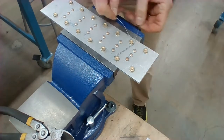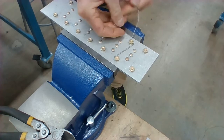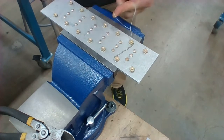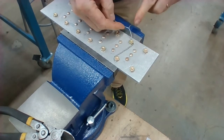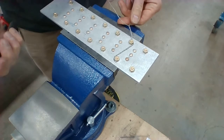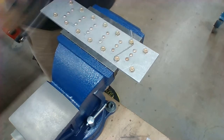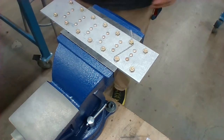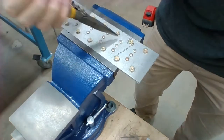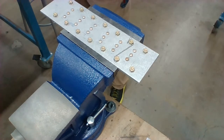Now when I come out, I'm going to go the opposite way — my left is going to go under and my right is going to go on top. I'm just going to continue doing this for about an inch or so. That's about as much as we want. I'm going to cut off my end with about an inch left, and then use the needle nose pliers to tuck that under so that nothing's scraping. That right there is a fairly decent wiring using safety wire.